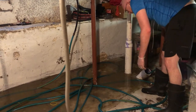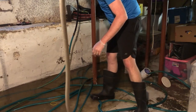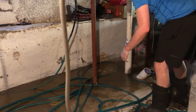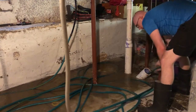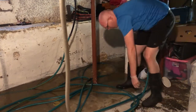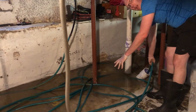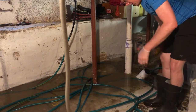Making sure I've got tension. That bladder's swelled up quite a bit. Since I was able to push it down further, I'm going to go ahead and turn this water off again and see if I can get on down the line any more. Water's off. Give it a second for that bladder to alleviate the pressure so that I can push it down further. It's going down further. Now I'm going to hold this hand, kind of hold that pipe there, and turn the water on. I just wanted to hold that garden hose so that as the bladder is building pressure, the force of the water coming out of the bladder wasn't backing up the pipe any. As you can see, it's still right where it was, so that's really good.